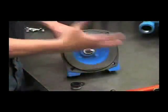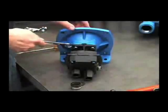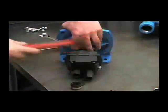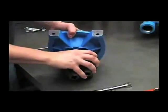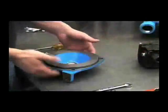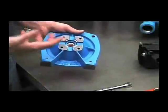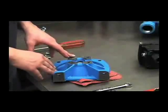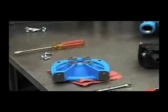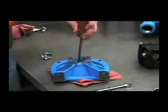We're actually going to take the flange off first and take it out from the backside. So to do that, take your half-inch wrench and remove these four bolts, and pull the flange straight off of the motor. Now we'll remove the seal seat from this side. If you were going to try to reuse a seal, you'd want to put a rag down to help protect the seal from any damage or dirt — you want to make sure that you have a very clean work area. The seal can be tapped out from the backside gently with a screwdriver.